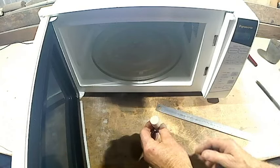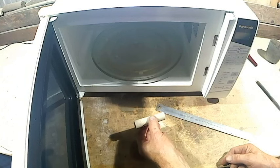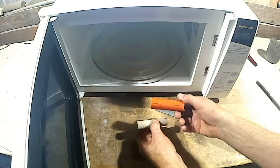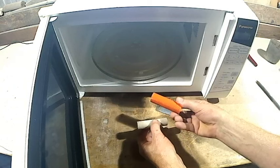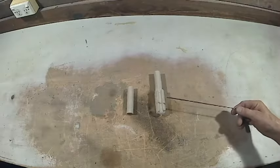and that won't be completely round. So what you'll have to do with smaller cores like this and using PVC as a mould, you probably have to use much less time. I put 2 minutes, it's way too much. Started distorting your core mould. Here we are, there's the finished cores.